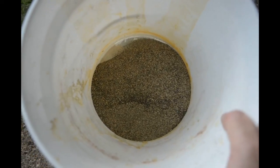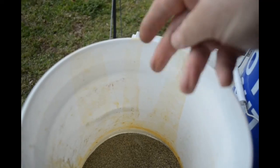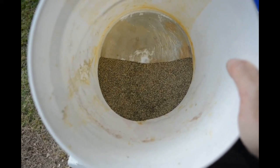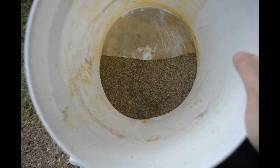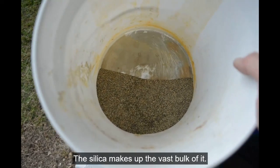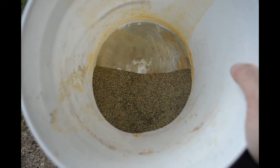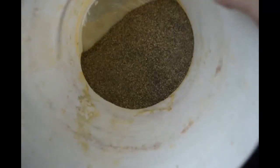The oversized stuff I'm dealing with separately because that's almost all metal. So what I've got in here after all that processing is fine sand-like stuff made up of bits of metal from the IC chips, including the gold bond wires — they're in there somewhere. And a whole lot of silicon die material that's been ground up to the consistency of sand. There's also a lot of copper and steel that's made it through the sieve; there's a lot of internal wiring on these IC chips.